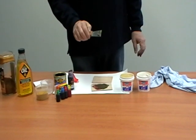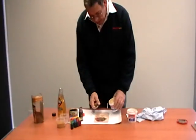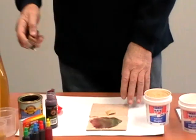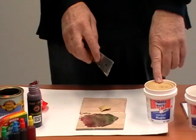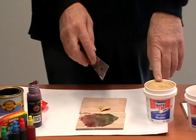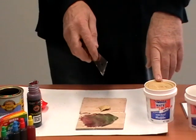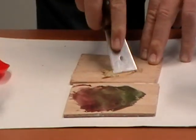From that khaki colour, all I'll do is let it dry. When it dries, don't worry about the fact that it will dry lighter — it's how it finishes that matters, and it will always finish back to this wet colour. It's very easy to use and very easy to apply. If the putty looks dried out of the container because it's been left open on a warm day, don't worry — just keep adding a few drops of water. If it's a little bit thick and doesn't want to spread easily, add a few drops of water to make it really pliable.